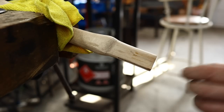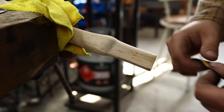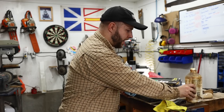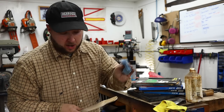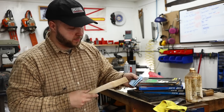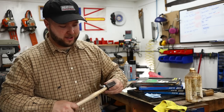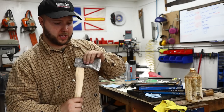While it doesn't really matter how the internal surface looks, that shoulder is going to be hard to clean up afterward, so you want to get it as fine as you can with a file and bring it in with some sandpaper to make it nice and pretty. Now for the mounting process, I like boiled linseed oil — classic, heavily used in axe production. But be careful with your towels: don't throw them in the garbage bin. You want to burn them or dispose of them properly, because boiled linseed oil has an activator that generates heat to help it cure and dry — if you throw them in your garbage bin you could have a serious fire on your hands. I've oiled the neck down over the shoulders of the axe.